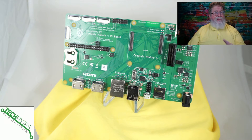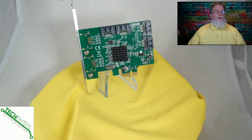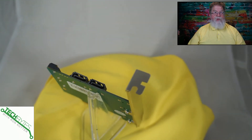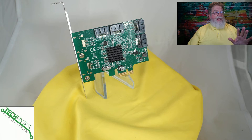I'm going to show you a couple of boards that let you take this to the next level. Some of you may have seen my videos on Open Media Vault versions 4 and 5, where you can make a small NAS. Well, with a four-port SATA board, you can run drives directly off the Raspberry Pi without using a USB interface. This won't do hardware RAID — you'll be doing software RAID using MDADM, as covered in the Open Media Vault videos. There is a board that almost got released but was pulled from production due to current shipping problems and pricing. There is one that will take the Compute Module 4, plug it directly in to replace the I/O board, giving you a very compact RAID system. You can tie in up to four SATA drives.